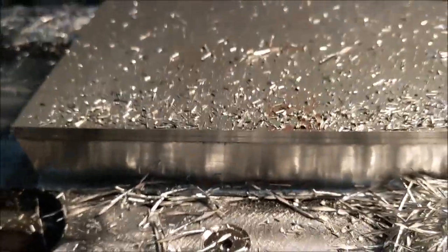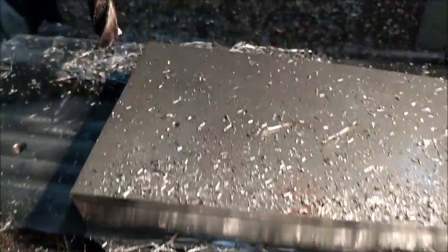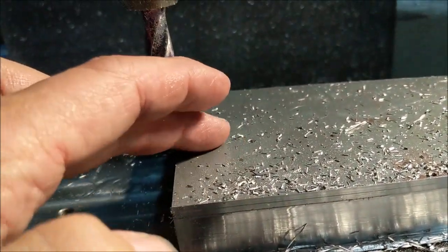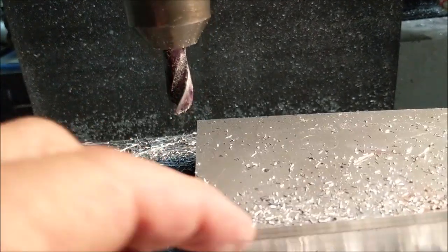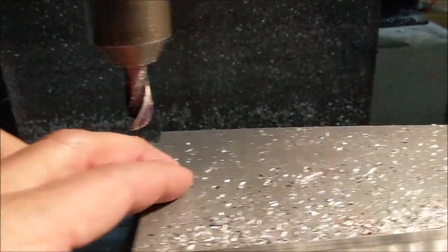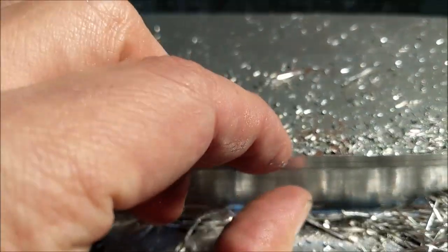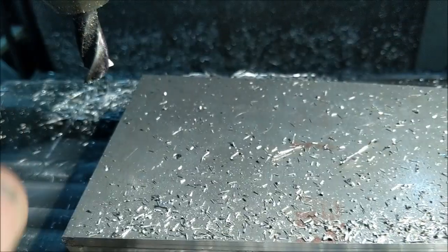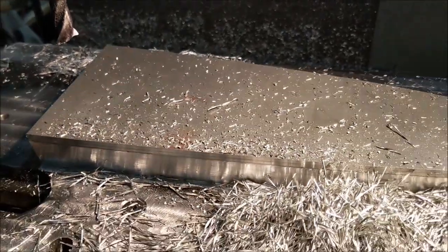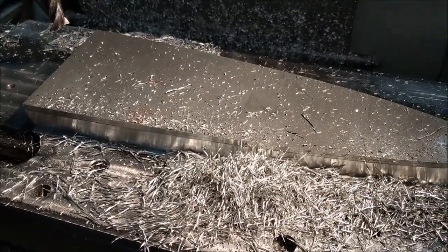You can see the vertical part of the profile cuts from the roughing cutter are still there. The last undercut pass is really dependent on the top of the material being at finished height. So what I need to do is get the top of the material set. I'll pop in the last profile cut, which will make this flat area just a little bit wider, and then the last undercut pass will shrink that up to match the round-over. So the sequence from here is: last profile cut, face cut, round-over cut, then the final undercut pass.